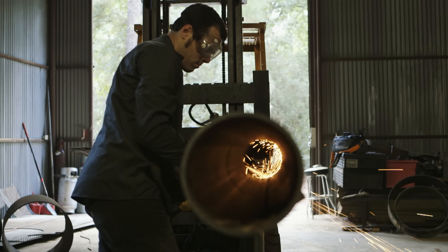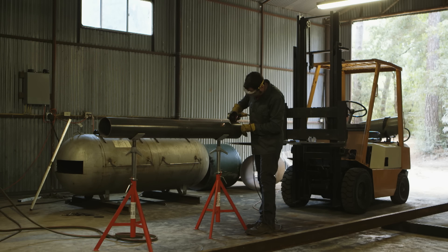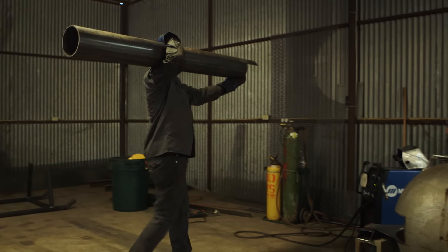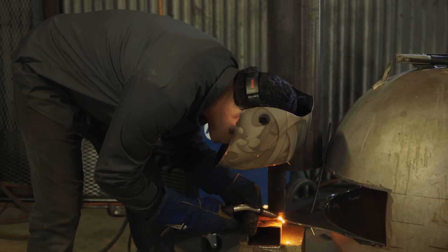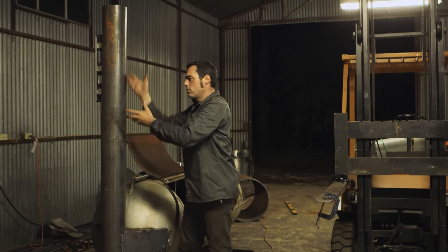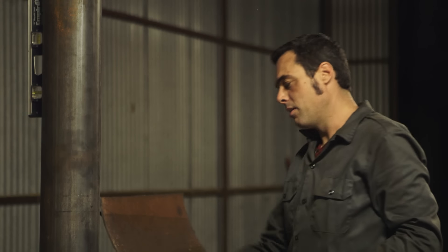There's certainly no shortage of opinions on smokestack size. For diameter, I like to go between 6 and 10 inches. My smokestack starts way too tall, so I can cut it down — it's a lot harder to add something to it. If it's too tall, the air going up is going to cool off and start to drop. If it's too short, you won't actually get a good natural draft, because you need different pressures to pull heat and convection across the grates.